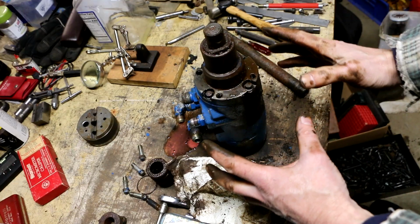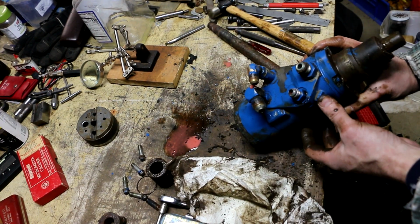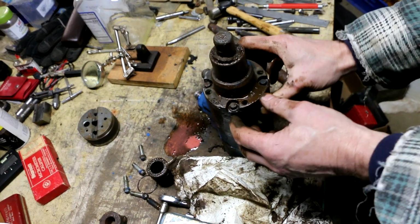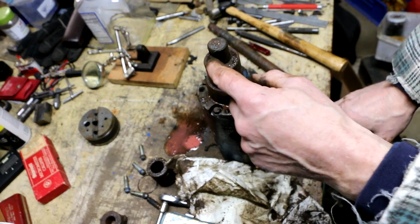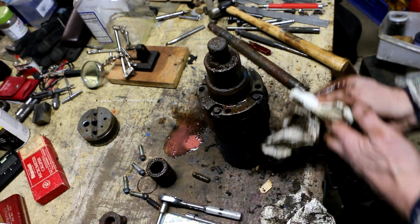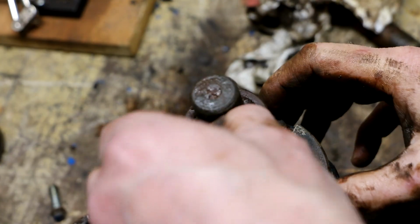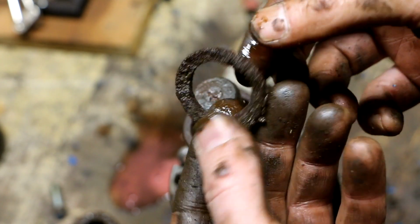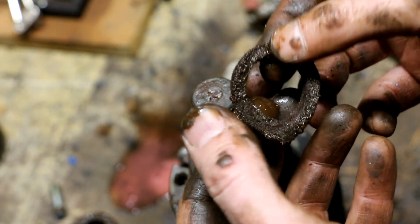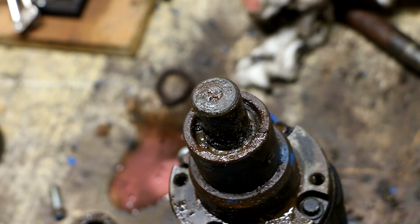All right. So at this point, we have now left the realm of Ford parts, and we are in the realm of what is strictly a TRW component. What is going on? Oh my. Is that the seal? That can't be the seal. That's got to be a felt washer or something that sits on top of that. What I'm looking at is whatever this is that's sticking up right here. Yeah, that's some kind of a... That used to be like a felt washer or wiper that is completely turned to mush. And below that appears to be more of a traditional seal. Quite the mess.